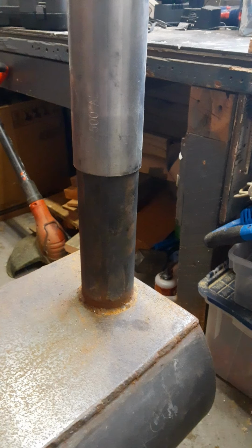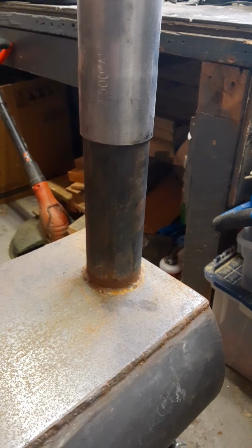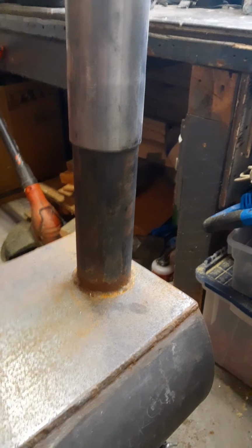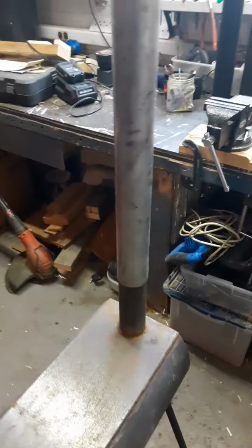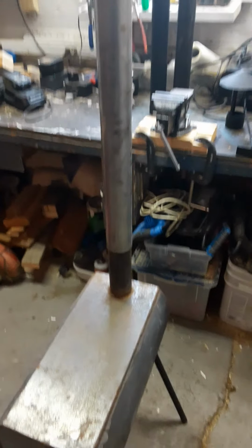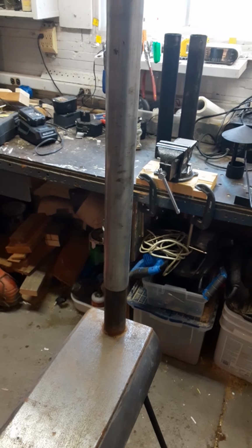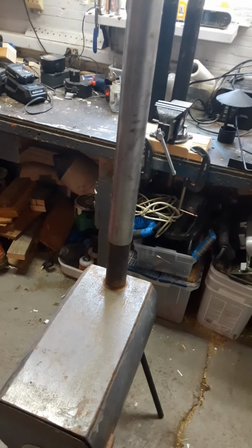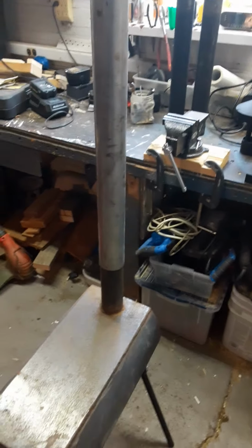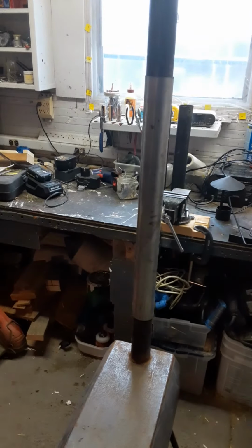installing bigger tubes. You've got enough room here, you could install a standard 6-inch chimney flue, and there's a damper you can buy. I would maybe think about doing something like that if I had to do this over again, because it would be a little more standardized, make it a little easier. There's no damper really on this stove per se, aside from what's on the door, which I'll show you in a second. So that's the stove, the pipe, and those modifications.